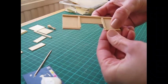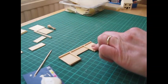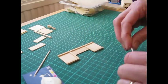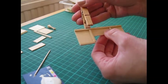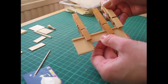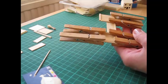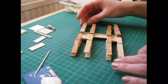When attaching mouldings to wood, as the glue begins to dry they'll try to curl away, so you always need to secure them. Use a clean cocktail stick to remove excess glue from along the join — that's really important if you're going to be varnishing the piece, because varnish won't take over glue residue. Always remove as much as you can as you go along, then give it a final sand before varnishing. Use clothes pegs or mini clamps to secure the mouldings into place along all the edges and corners. Then that piece can be left to dry.